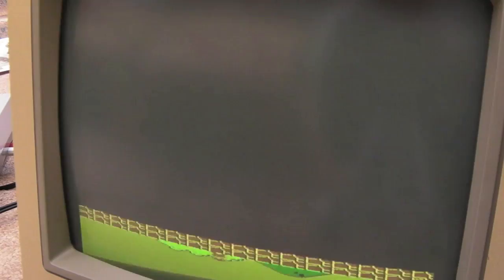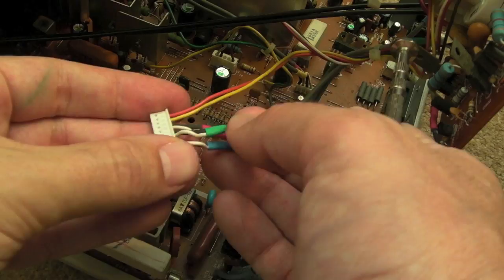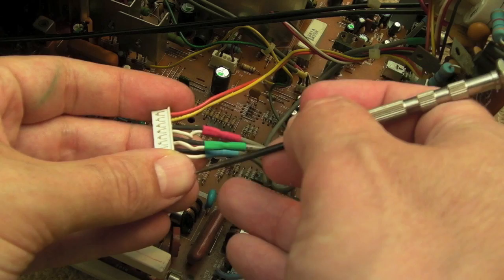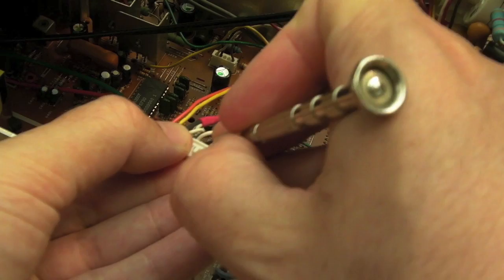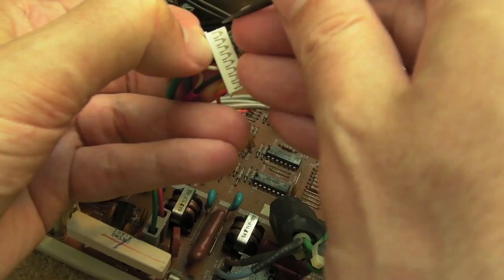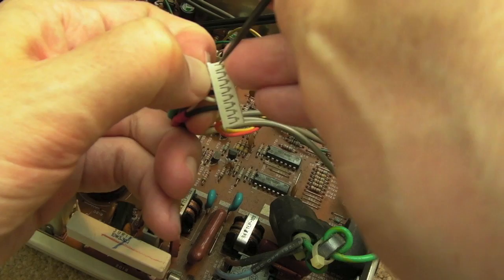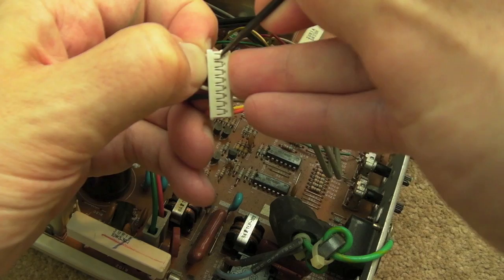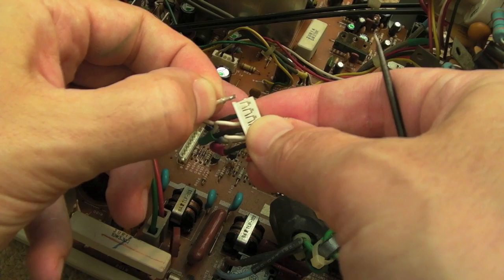The exact same problem after swapping out all three of those caps on the tube baseboard. So I'm going to try and swap the colours around on the inputs - the N2 colours, I'm going to swap blue and green. We've just got a ground for each one and then the colour. If I just stick to the colour designation of white, black, white, black and just flip them - the easiest way to do that is just to gently - it's like a JST type connector - just use a pin or something to lift the plastic part, and if you pull the wire at the same time. Can you see that's come out? Just pay attention to which way it goes - there's a little notch here that hooks onto the inside of that plastic part. And just swap those around - all done, swap blue and green around.